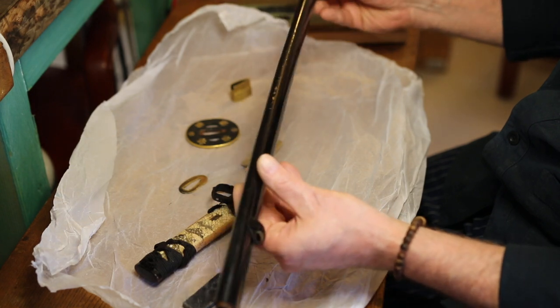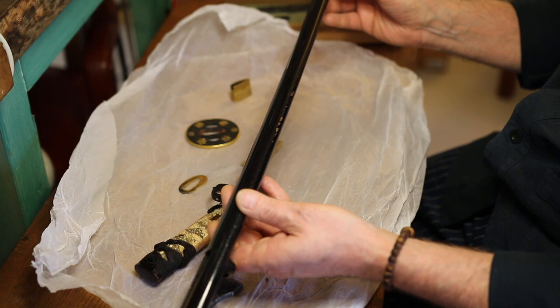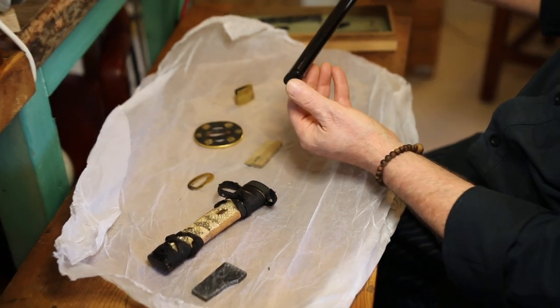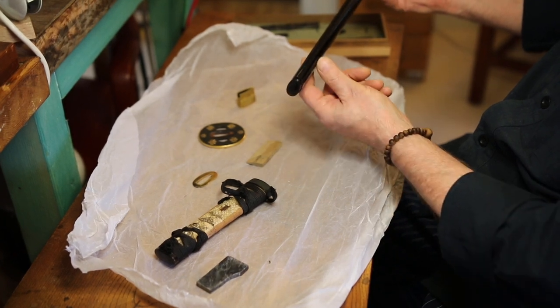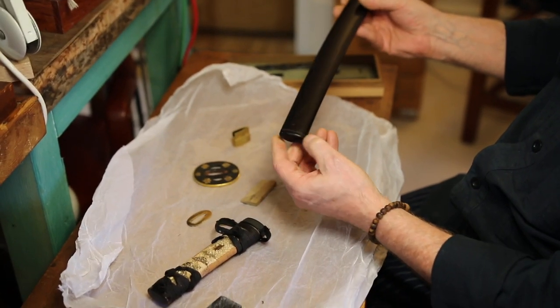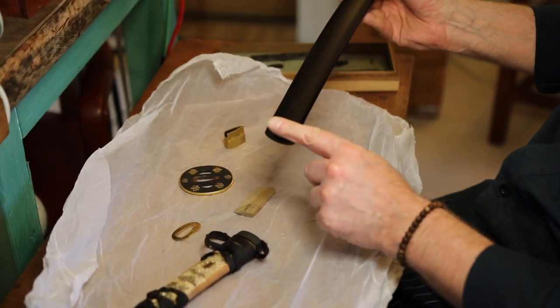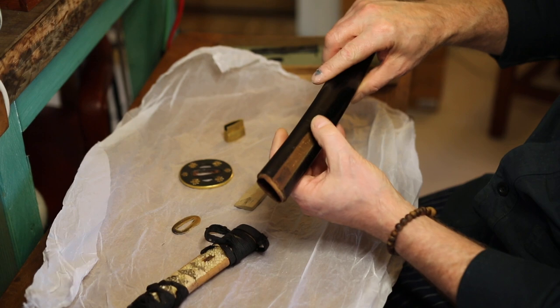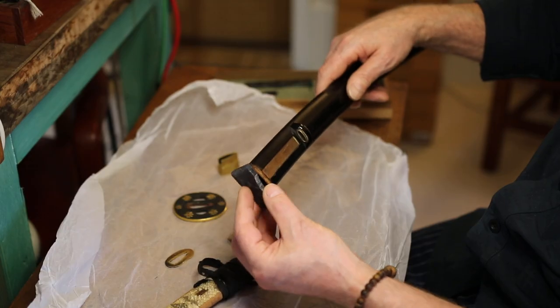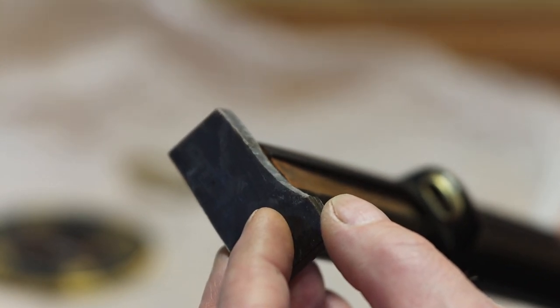The problem that this piece has is a few chips. This will be restored — I'm sending it to Japan to do that, I'm not going to do it. There's a split in the wood, which means that it's moved away from the kojiri. The kojiri is buffalo horn — it's matched, actually, by a similar piece at the end of the handle. So the wood has split and somehow moved apart — this is going to be a tricky thing to repair. What I'm going to do myself, and this is what the buffalo horn was for, is to make a new koiguchi — this is the reinforcing piece that fits over the mouth. Buffalo horn, as I said before, is a reinforcing material.